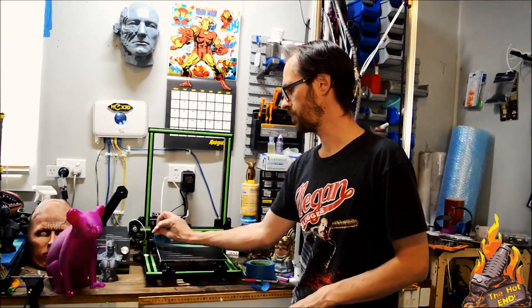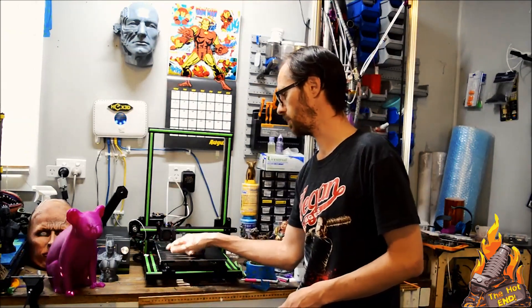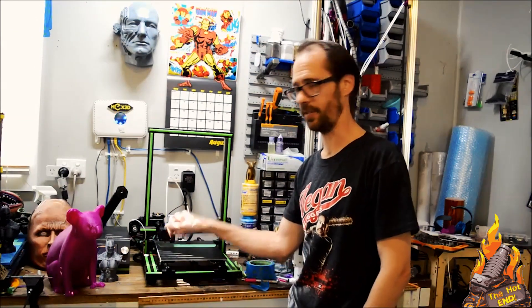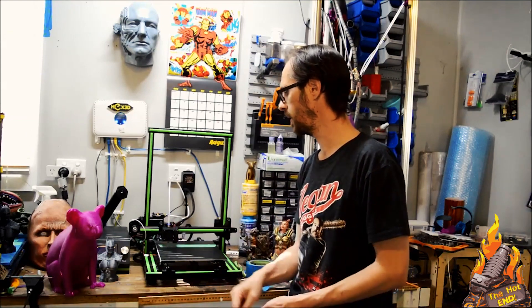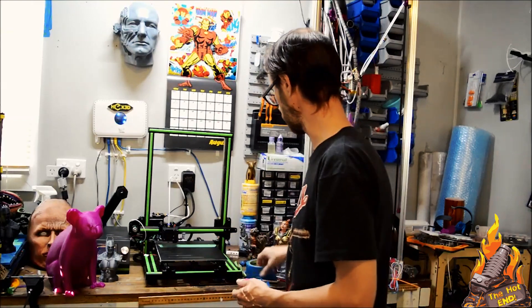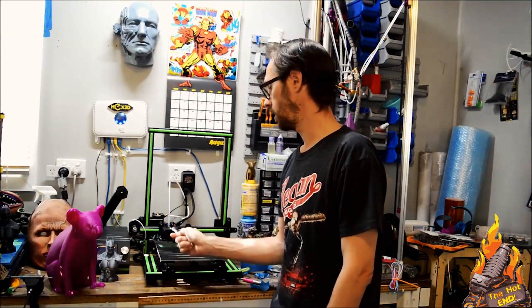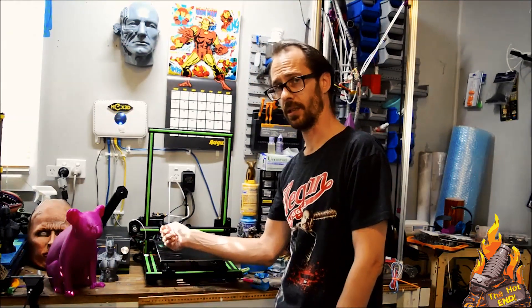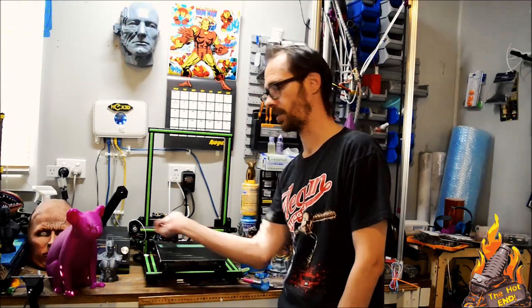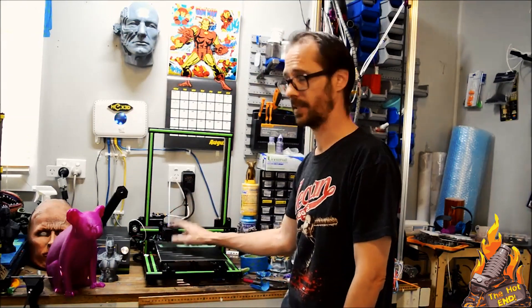I would suggest to people either look for some mods for a CR-10 or something like that where it improves the cooling flow. I'm personally going to redesign a whole new hot end for this, because it really needs a bit of improvement. So that being said, yes, it does the job, but it seriously needs some work. Get one of these, because you're going to be undoing this a lot. Be aware too — they also lock-tighted this PTFE connector in, so the first time you undo it it's very, very hard. You won't break it if you're lucky, but be prepared to take this out a lot.